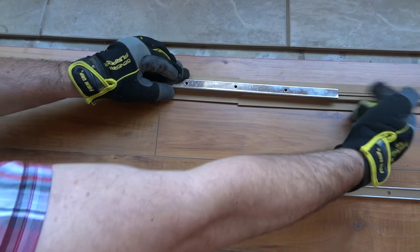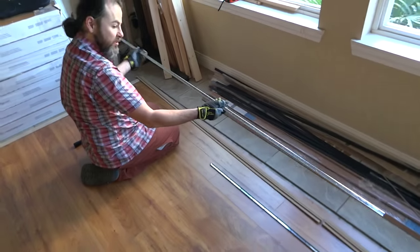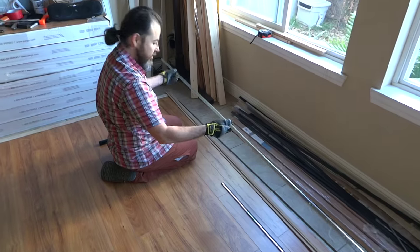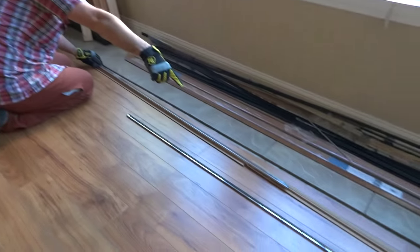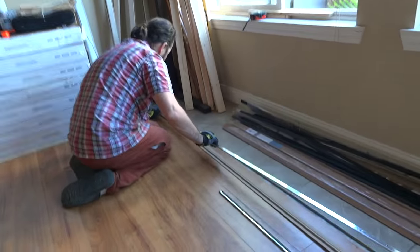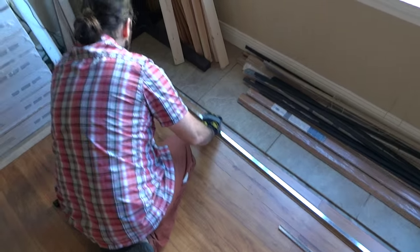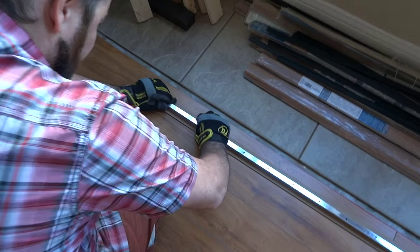The excess amount here I'm going to cut more track to finish off that piece. So let's install this metal track — this first piece of metal track is actually the uncut piece and it's going to overlap that joint by about 12 inches. So let's go ahead and snap this track into place. I'm just going to line up the end of the track to the end of this T-mount right here, and it snaps in fairly easily once you start getting it in.